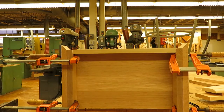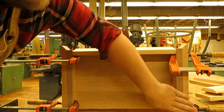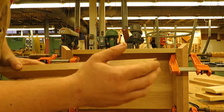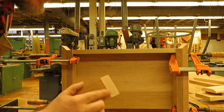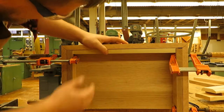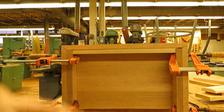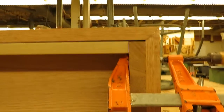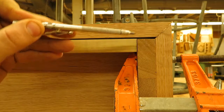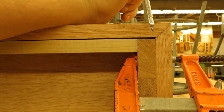I dry clamped both side molding pieces to their final positions, then I'm going to take the front molding and line it up again. I cut it close to the line I'd drawn — let's see how well it fits. As you can see, there's a gap on both sides, which tells me the length of the front molding is bigger than the opening we have.